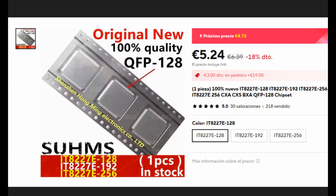The good news is the Super IO — the IT8227E-128 — is available. The bad news is there's a circle in the top right of the listing, meaning it needs to be programmed. I can't just fit it directly; I have to get it, program it, and then solder it back in. It's apparently going to arrive before Christmas, so that's my video for this week. Hope you all enjoy — please like, subscribe, and put any comments or questions down below. Thank you.